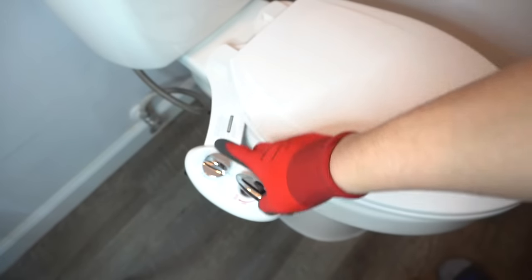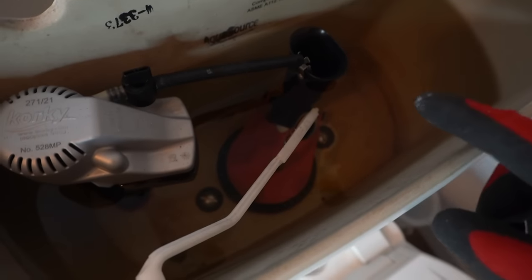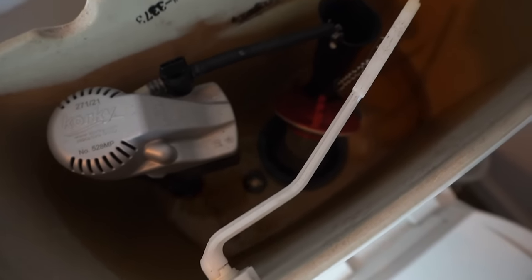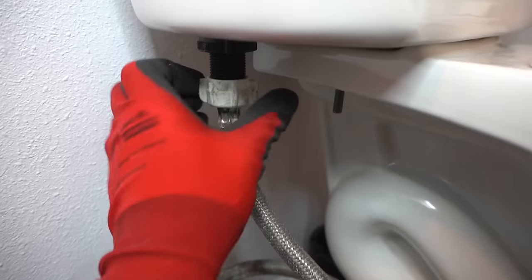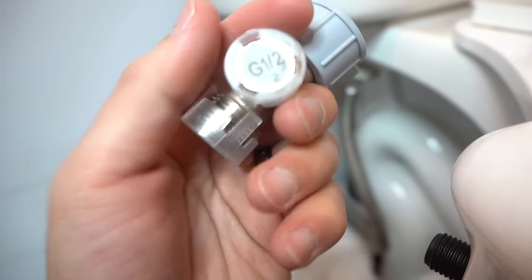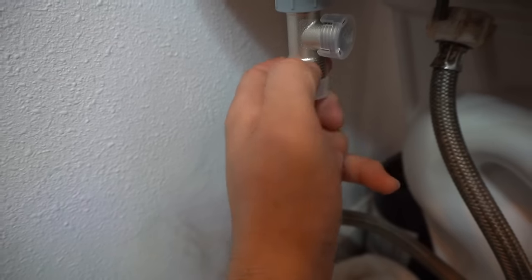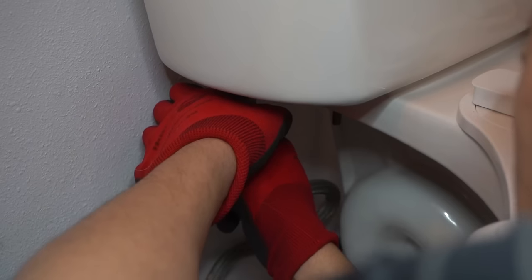Now it's time to hook up the water at the back. Disconnect this water supply line from the tank. The problem is your tank is probably full of water right now, so you want to drain as much water as possible — flush out all the water in there, hold your flusher. You can get a sponge, turkey baster, or any type of syringe to take out the rest of that water. Drag something underneath to catch water. Take the T-adapter provided by Luxe — it's covered with a cap labeled half-inch seven-eighths — connect it and hand tighten first. Take out the bottom protective cap, replace it with your old connection, and hand tighten. You don't want to over-tighten this.